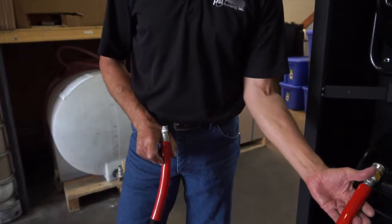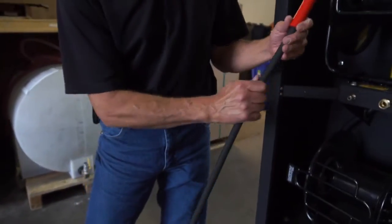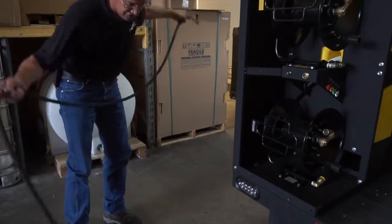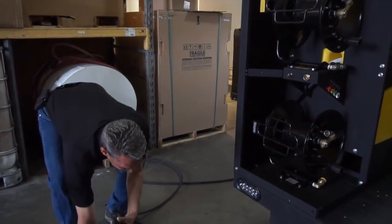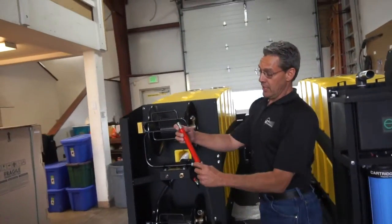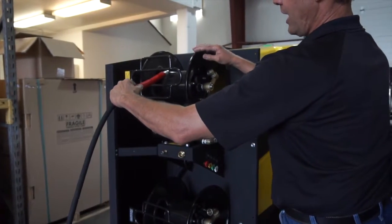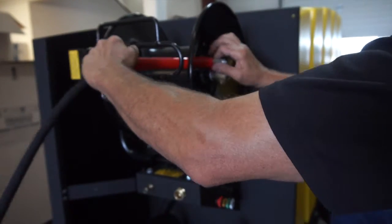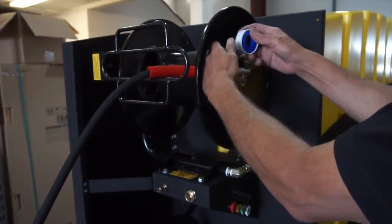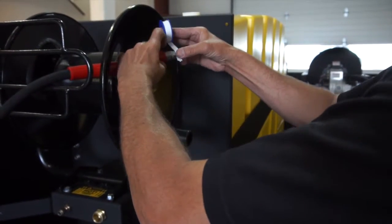The easiest way to attach this hose is first to extend the hose out, unravel it, and straighten it out in a straight line behind the unit. Once the hose is stretched out and straightened, the short rubber protector on the end going into the hose reel needs to be laced through the guide on the hose reel, through the side hole, and threaded into a fitting on the hose reel swivel. Before threading, wrap the threads with several wraps of the Teflon tape that comes in the packet with the unit.